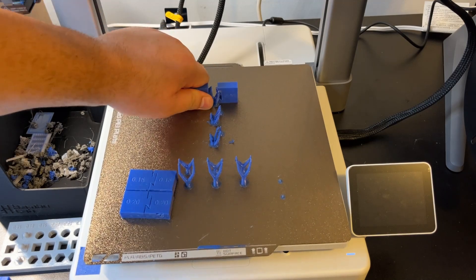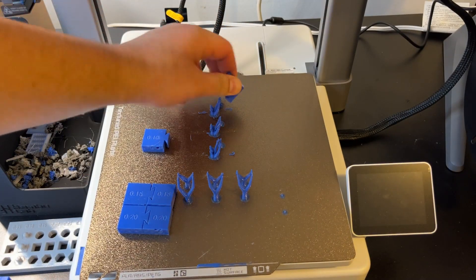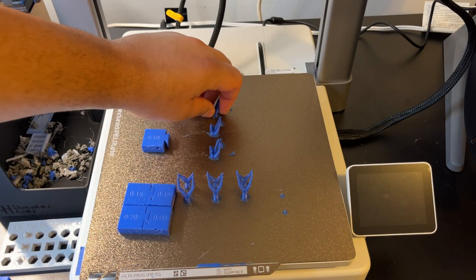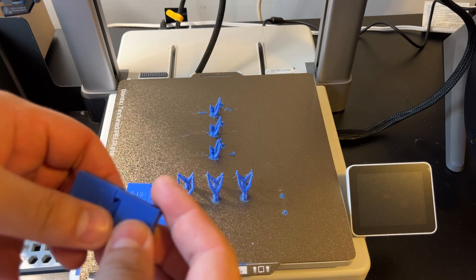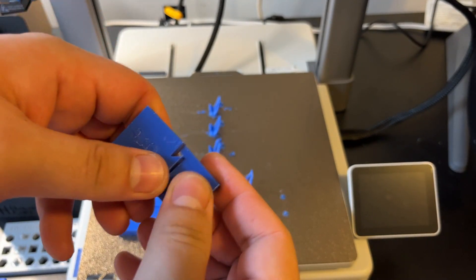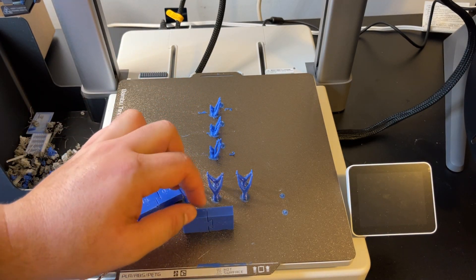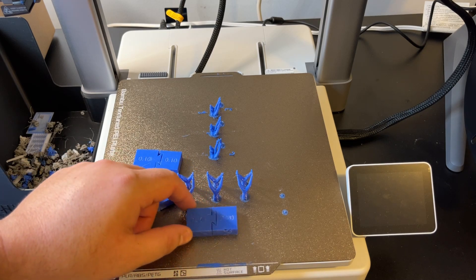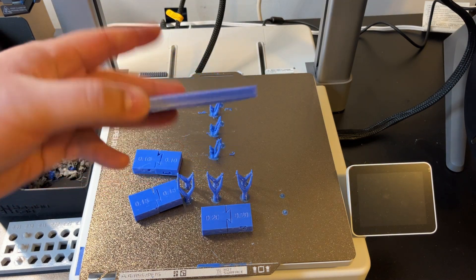As you know from yesterday's video, both of these had a pretty big tolerance gap. Let's see about the last one — the tightest one — which is 0.1. The print quality is looking amazing other than that layer shift. Oh, this one didn't work out — it actually broke. It might also be because of my tree support settings; they're not standard generic settings, they're my own personal settings. That's unfortunate, but it looked like it would have been tight. Usually with these latches I wouldn't print them vertically anyway — anytime I do these sorts of latches they are printed in this orientation. That's the Z-plane tolerance test — worked out really well.